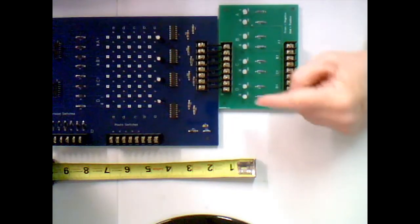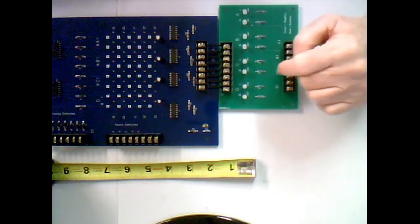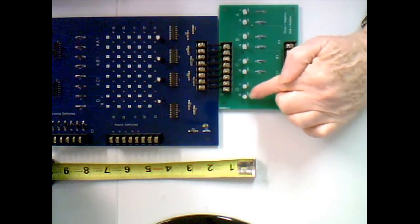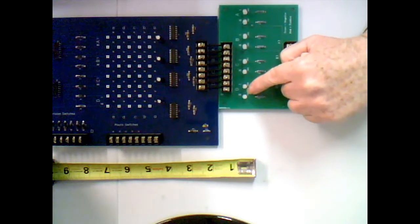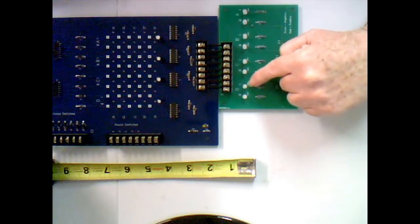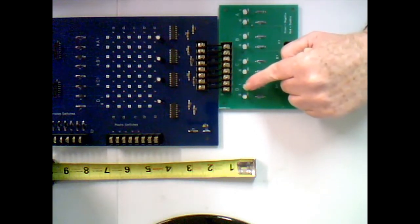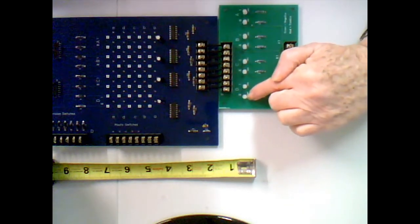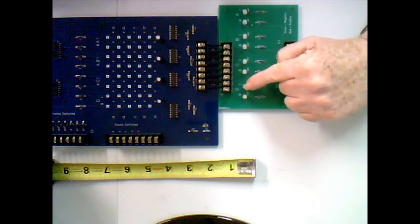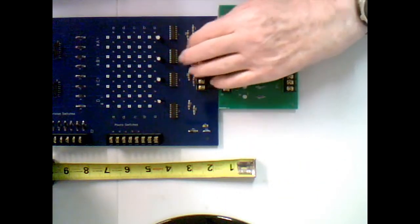So you locally just throw your switches, get your route set, and each one of these will have a red and a green, red and a green, red and a green, red and a green indication. So you remember the green ones. And so here, for example, here's tortoise motor D, terminals on the tortoise motor 1 and terminal 8. So let's say terminal 1 has got a green light on it. That means that terminal 8 has to have a red light on it. And the tortoise motor is thrown one direction or the other. So remember that D has a green on wire number 1.